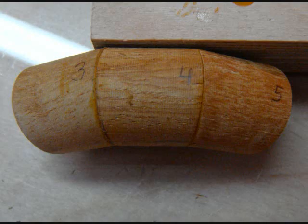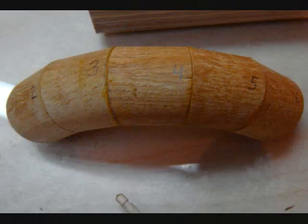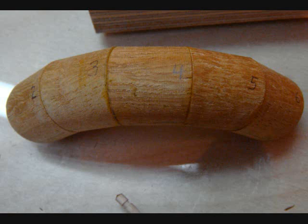I always start gluing in the middle of a bend, so I can glue two pieces on at a time to save time. What's not shown here is after each section dries, I round the inside and finish sand it with a Dremel while I can reach that section, and slowly add more sections and continue to round the inside and work my way through the piece.